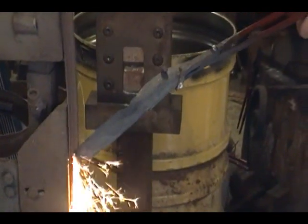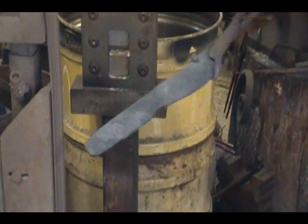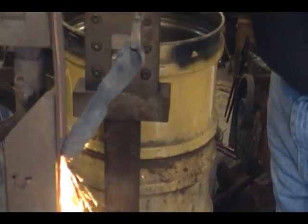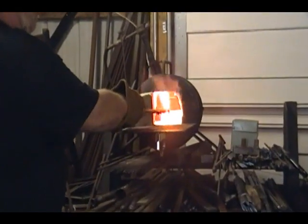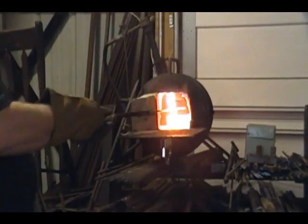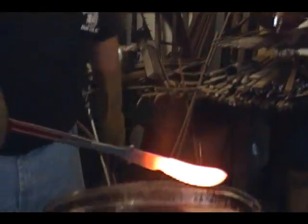This is still probably close to 1,000 degrees, so we're going to the belt just to save time. We're going to bring this out of the forge, check to see if it's non-magnetic, and go right to our quench.